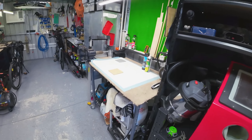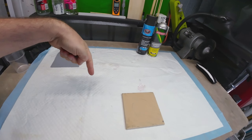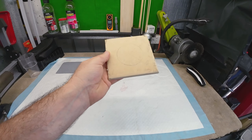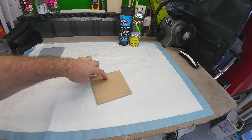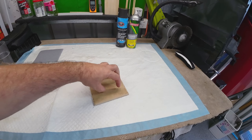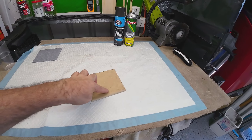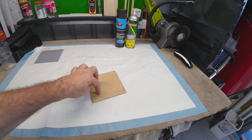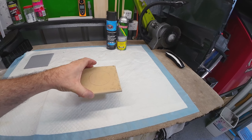Okay, so I've got that cut — 135mm by 135mm piece of MDF. I've just rounded the top corners off with the router and a bit of sandpaper, and the centre's marked. I think the thing I'm printing is 75mm, but if not, you can centre it using the mark. I'll glue that, do the edges nicely with some caulking just to make them all nice and rounded so there's no hard transitions. Then I think I'll paint it.